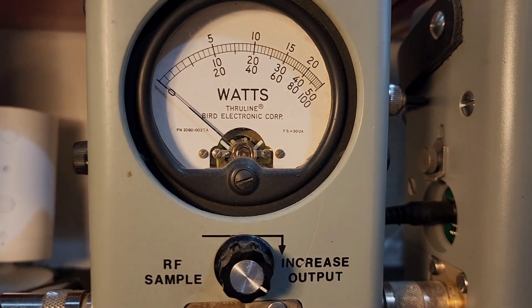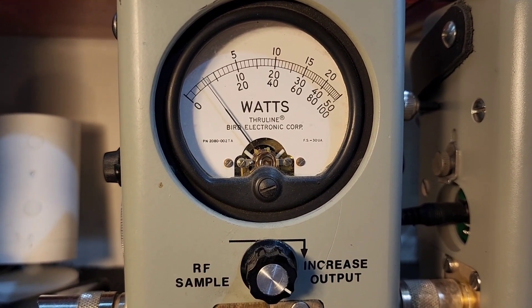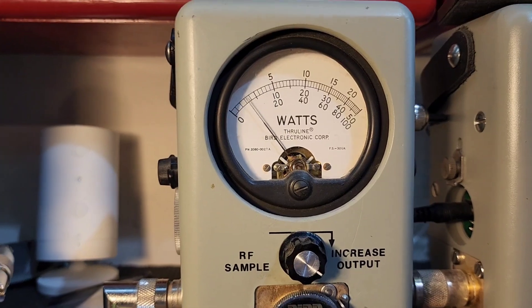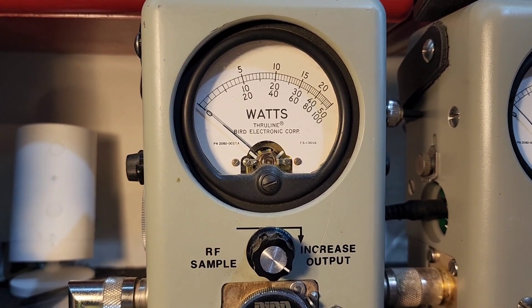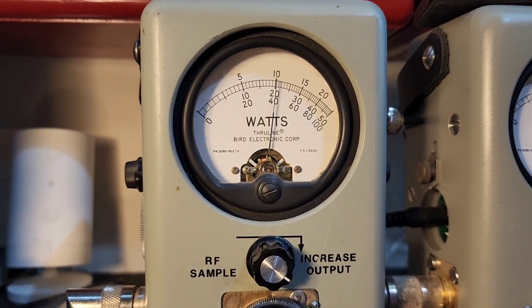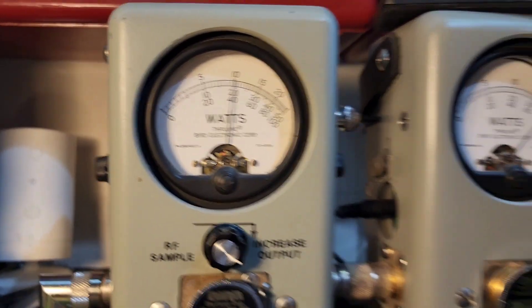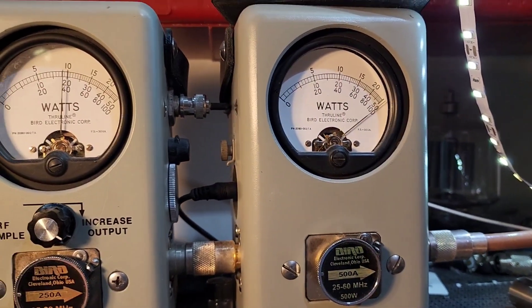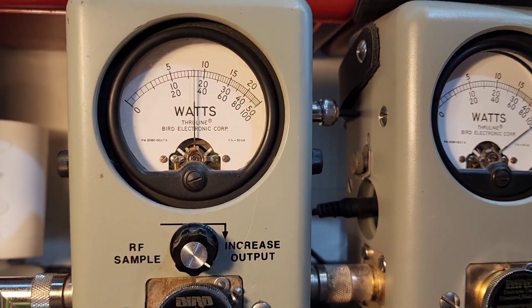I'll start with our power all the way down. We're doing a 250-watt slug, and it's sitting there about 15 watts. Hello, swinging forward to about 50 watts average. Let me roll it all the way up — 100 watts, swinging backwards. Hello. We're doing about 500, hair over 500 maybe a PEP. So PEP's good where it should be, but we're low on average numbers.